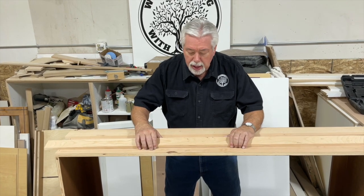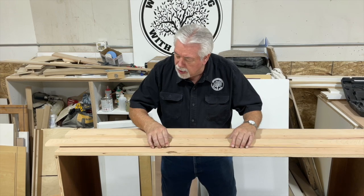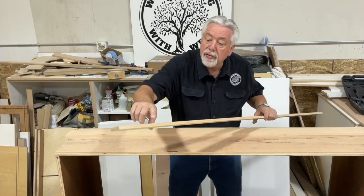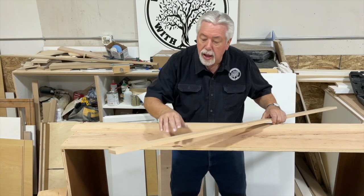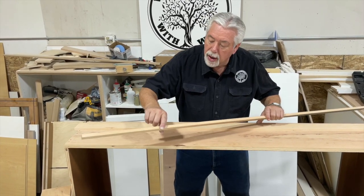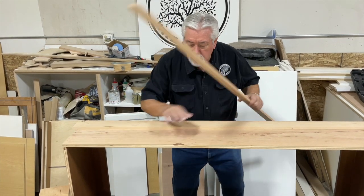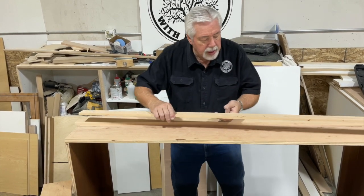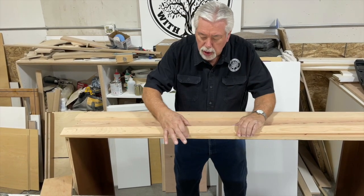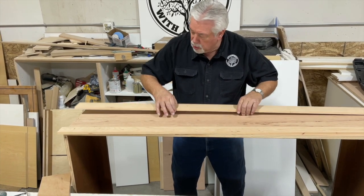The pieces that we made are half inch thick and we have put on them a 15 degree bevel. We're going to turn the bevel to the inside and make a real nice little beveled inside panel. Our front piece is going to be two and a quarter inches wide, and our back piece is going to be three inches wide.